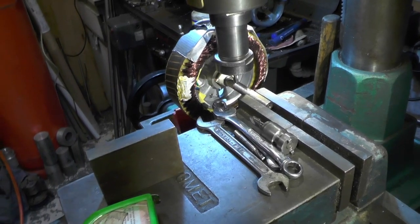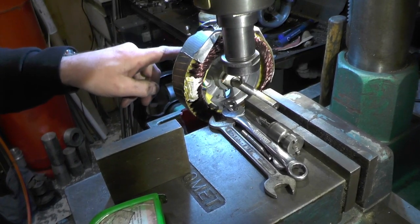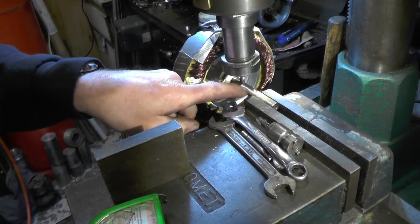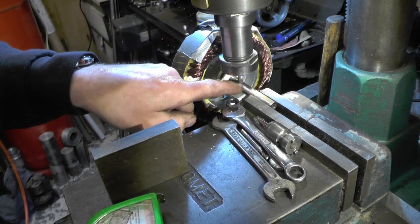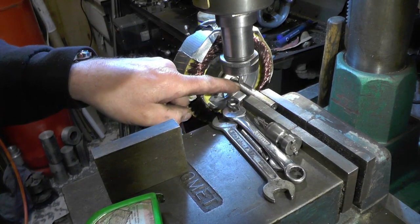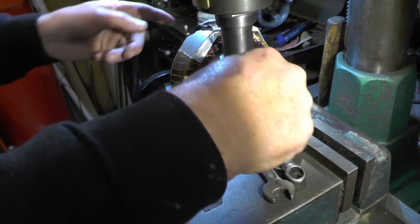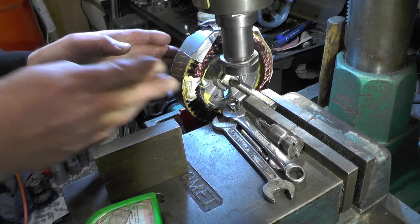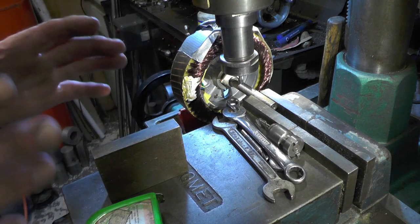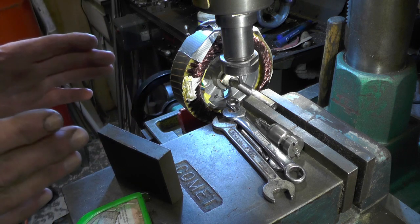I've moved over to the milling machine now. I've got both my threads cut on both sides and I'm just going to reproduce this flat on both sides up to where it comes to in the forks. When I've done that on both sides, I'll be cutting them off to a suitable length to fit my forks — it's a 100mm dropout.